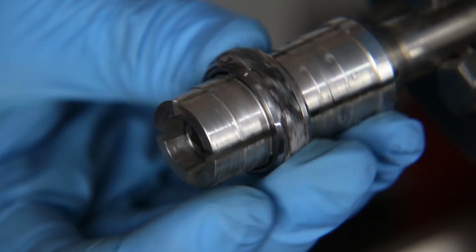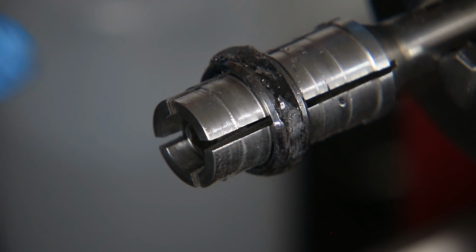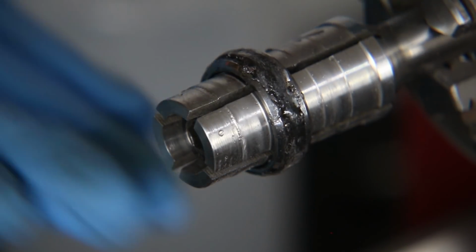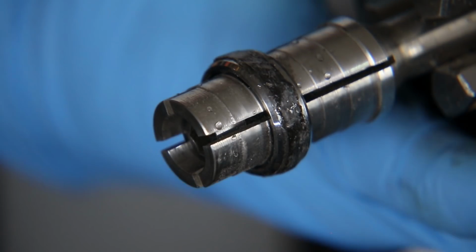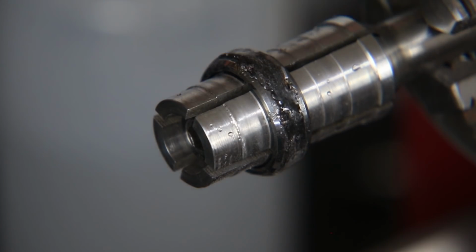All right, so the water that he's putting on there, that is to keep everything cool. Super glue, if you overheat it too much, it loses its glue properties, so it's gonna fall apart, and it's also going to look worse. It's only if you get it extremely hot, so it's not as important as I'm making it sound here, but it is something you wanna be aware of. You don't want your material to overheat, so just keep it cool. You can use water, or you can just be a lot more gentle with how you sand it.